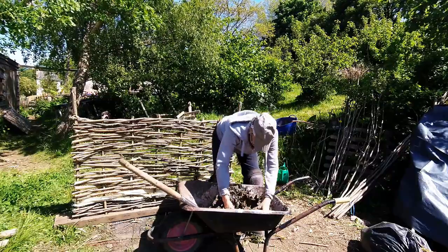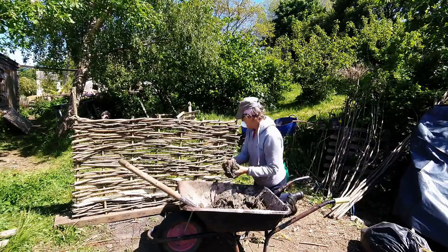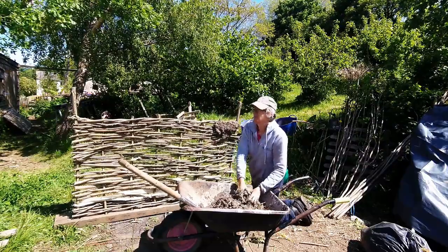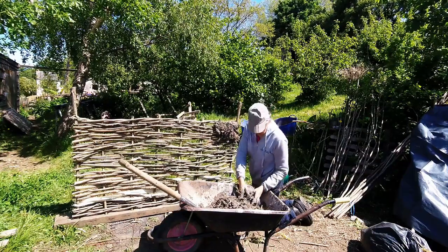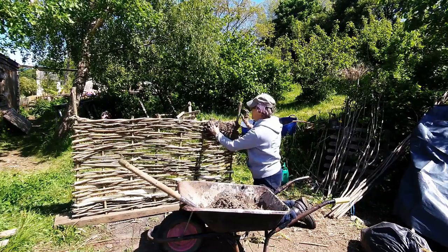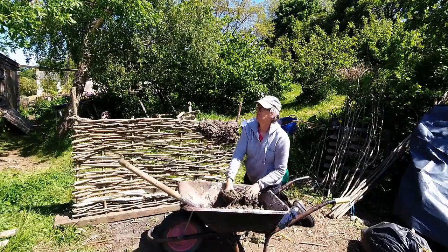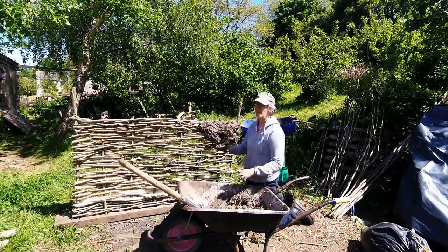We literally get a loosely fist-sized amount, squash it on, and press it into the cracks — it keys into the cracks, so in some ways it's quite good to have gaps. Once it's dry, people then used to plaster it with plaster made of lime, and sometimes they mixed in colouring with it — I think it was just traditional in different parts of the country. The lime helps to keep the rain off, and sometimes people even put decorations in the plaster with little raised bits or incised carvings.